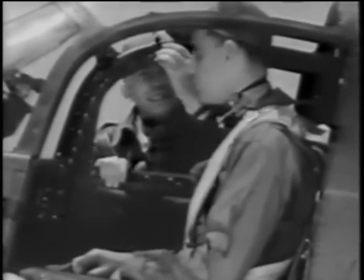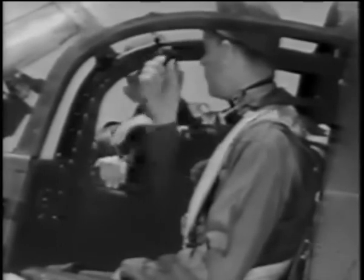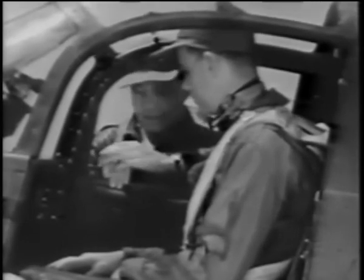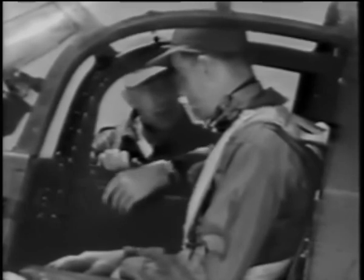There's a top latch up here on each door. It keeps the door from being sucked outward at high speed. Be sure they're both fastened securely before you take off. And be sure the door handle is in the closed position, that is, horizontal.